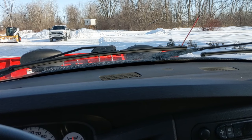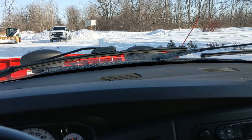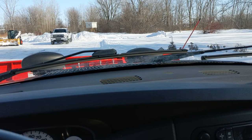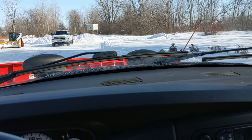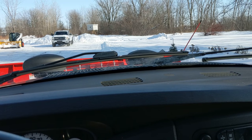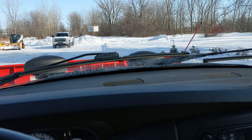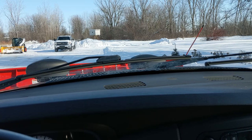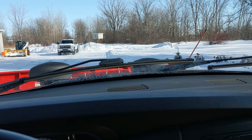For instance, you don't want to push snow from a parking lot out to the entranceway and have huge piles of snow stacked on each side of the approach or the driveway. When someone goes to pull out, they may not be able to see around the piles and it could cause them to pull out into traffic and possibly get in an accident. You also have to keep in mind that you don't want to block drains, furnace vents, or anything that has to be kept clear.